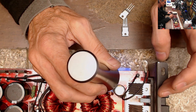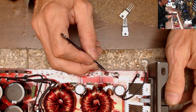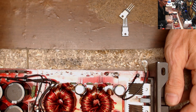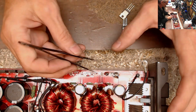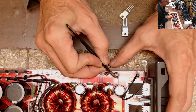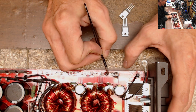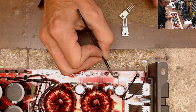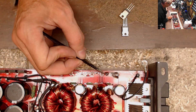Let me make sure this is cured up really good here. Just like that — now you have rock solid fiberglass-infused areas of resin. The resin is all cured up, it's level, it's flat. I can put a new zener down, I can lay down a new gate resistor here, and probably get some new copper down to repair those areas.